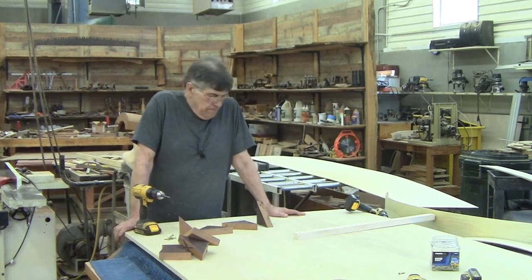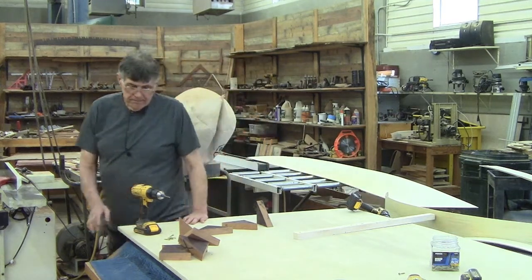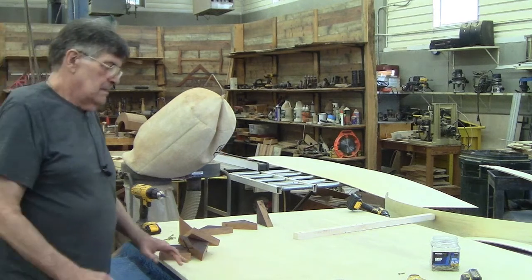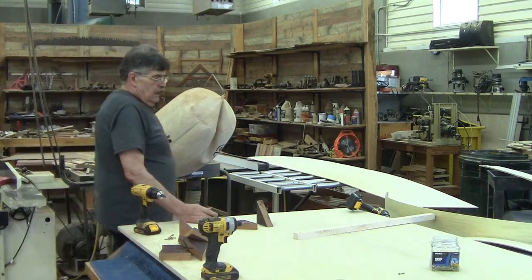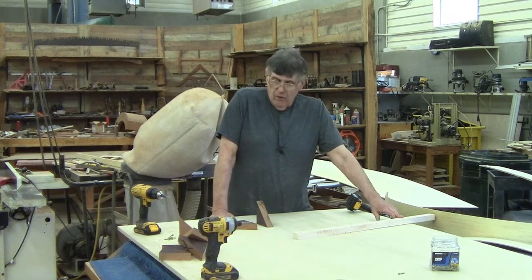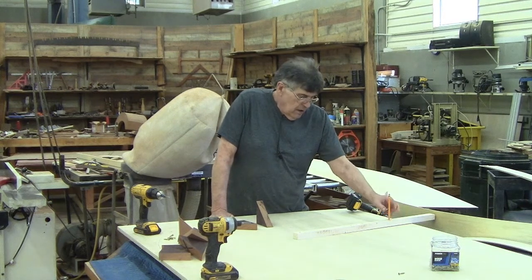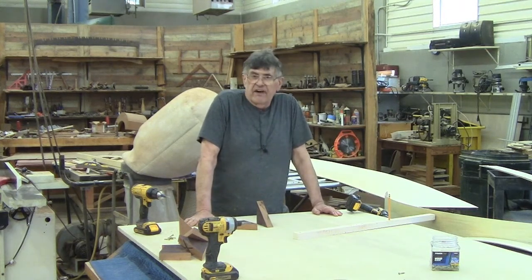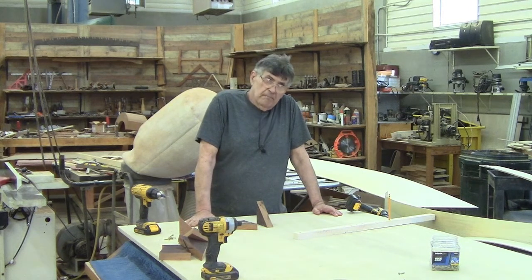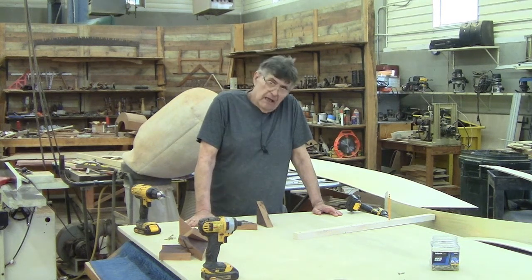So the biggest deal I've got is how many blocks it's going to take to put this thing together and see if it works. Oh, I was talking about the compass. I'm sorry. Anyway, on this outer one, I just drilled a hole that a pencil fit in. That creates my top, and then I measured in my overhang plus the thickness of what my apron's going to be. In this case, my apron's going to be 5/8. So when I glue it up, there will be 4 1/8-inch poplar pieces, and then an 1/8-inch tiger maple on the outside of that. That should do.